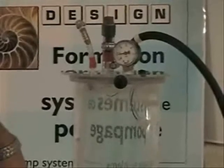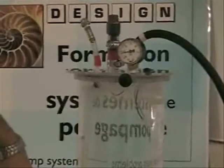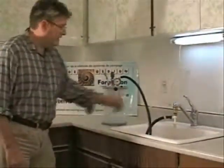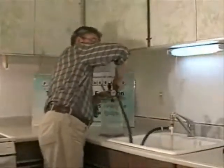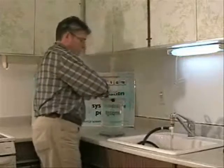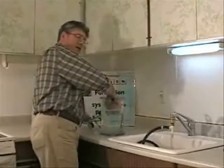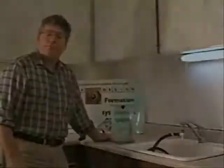I think you can see that this water is definitely boiling. So now I'm going to shut this off and show you that this water is actually quite cool. Quite easy in my hand in here — it's nice and cool. And there you have it: water boiling at low pressure.